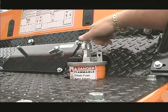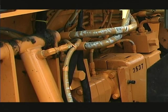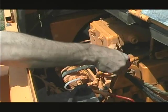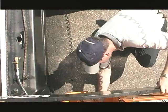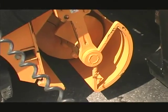Check the fuel supply by opening the fuel cap and checking the visible level. The fuel level can also be checked by looking at the fuel gauge on the dash. Before startup, inspect the machine for any malfunctioning, missing or broken parts and perform any necessary repairs. Check the hydraulic hoses for wear and leaks. Check fuel lines and tanks for leaks. Check the propane tank to make sure it is full. Before starting the engine, clear the auger and the feeders and make sure all covers and guards are in place.